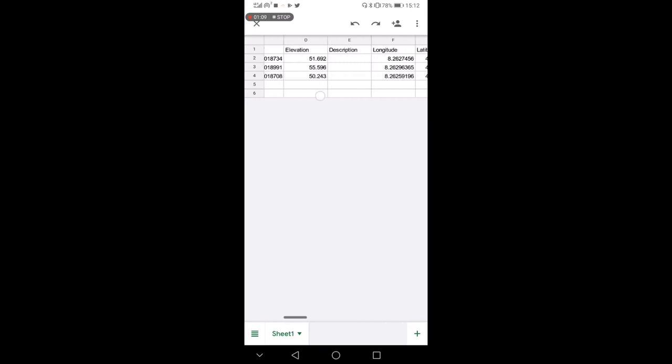And of course, you have to take care of one thing. Here I selected, if you look at elevation here, you have 51 meters. And it's the elevation with respect to the Italgeo, so to the geoid I chose. So 51 meters, I would say, above the mean sea level as defined by the geoid. But here you have the ellipsoid height, which is 99 meters. And this is basically the difference between the ellipsoid and the geoid. Usually these two for me are the same because I am used to collecting ellipsoid heights and then processing them in other ways.